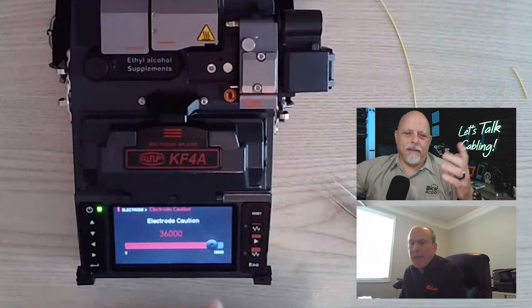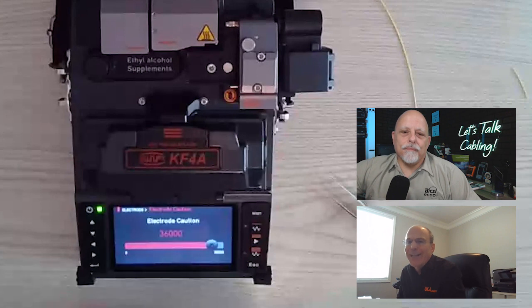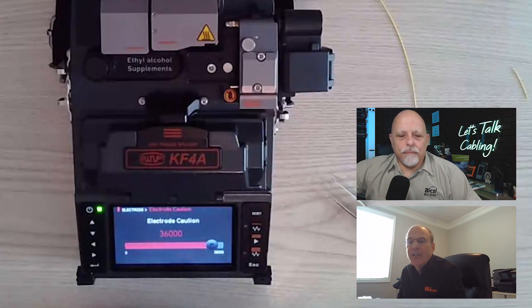Perfect. That's absolutely the reason I bring it back. I don't like to be out in the field, do one or two splices, and then have to change the electrodes. You want to do that back at the shop when you have more time, as opposed to in the field.